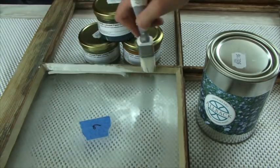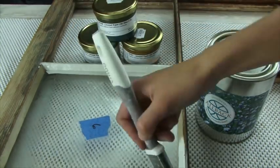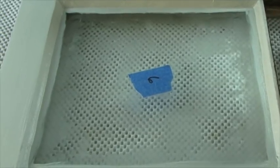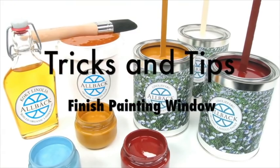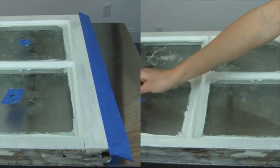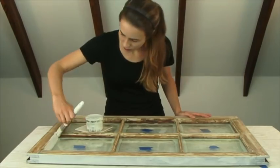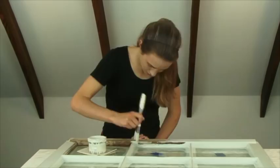Paint immediately. It is very important that you paint onto the glass — painting on the glass is one of the factors that gives the Allback linseed oil glazing putty its long-lasting strength. You do not have to be too tidy because we will trim the excess paint later. This combination of Allback products nourishes the wood, protects against weather, and creates a window that will last for a very long time. Paint off the top and bottom of the window so it does not stick to the window frame later. Remove the window markers. The window glazing can also be used to fill cracks. I would suggest three thin coats on both the exterior and interior sides of the window, with extra care to paint on the glass on the exterior side.